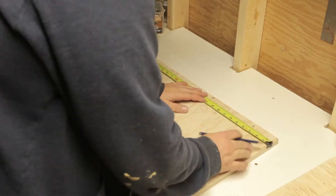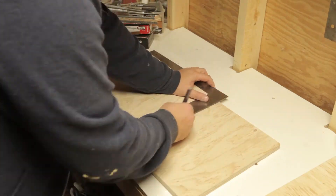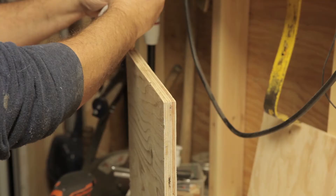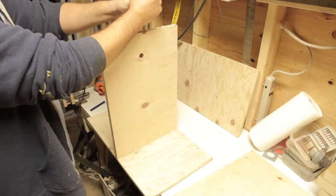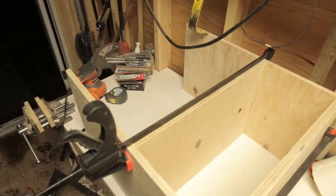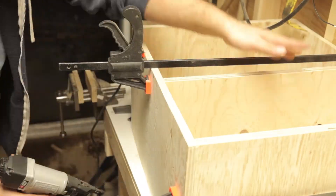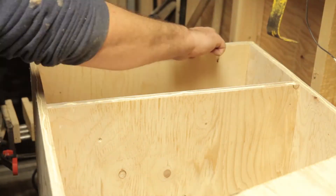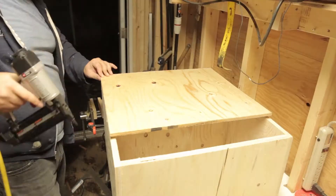With all the sanding finished, I did a rough layout to decide where I wanted the shelf. I decided on about 8.5 to 9 inches, measured that out on both side pieces, and drew a line. I started by gluing the center shelf just to keep things in one place, then moved on to the top and bottom. I used bar clamps to hold things in place while I got everything glued and attached, then used an air nailer to make sure nothing would move and everything was secure. I also glued and air-nailed a piece of three-eighth inch plywood onto the back to make it nice and strong and keep it square.